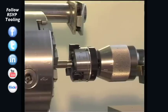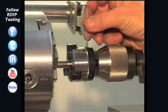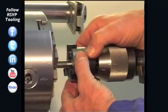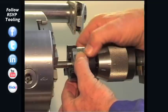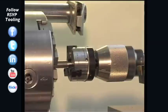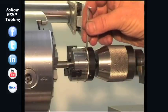Now we move over the workpiece and loosen the centering screws. The adjusting ring should now be turned to the left until all three knurling units enclose the workpiece and centre the tool head. The tool head is now centred and all three centering screws can be tightened.